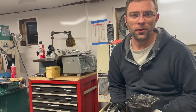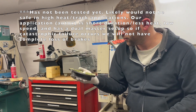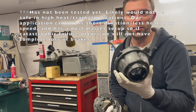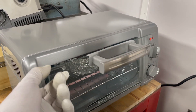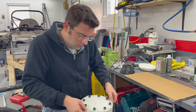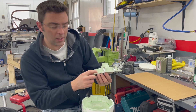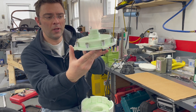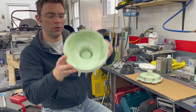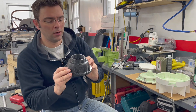We've got our parts ready to go into the oven for post cure. We've got the brake hat, which had some Kevlar on it — it meandered a bit down into the bore, but we'll see if that still works. If not, this one wouldn't be terrible to make in aluminum. And then we've got our sprocket adapter that we just freed from the mold. It's 382 cc's of carbon and it's got threaded inserts. You can see we've got a bolt pattern on the top. Inside we have lathe parts that we then hit on the mill so that they can't spin. We fill the top of the bolts with clay so that the bolt doesn't get glued into place and we can back it out and later dig out the clay. On the bottom side of the mold we also have threaded features. That threaded feature goes along with this spline pattern to couple the drive torque to the diff.